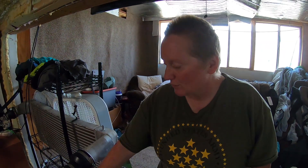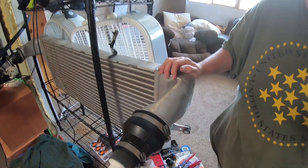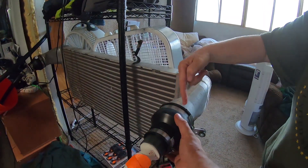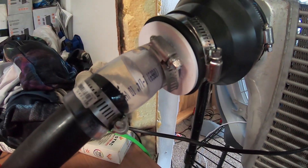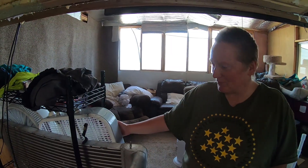To go over again for those that don't quite get it: the piping is all underground. You get a pump to circulate the water, and then the cold water from the ground comes up through a radiator. You can use any radiator as long as it doesn't leak — this one is an air cooler out of a big truck, aluminum, so it won't rust. You can use car radiators, motorcycle radiators, or go to the junkyard. The water pumped through the fins extracts cool air, and then your fan blows the cooler air out. It routes through the ground again and starts the process over for a lot less electricity than compressor AC — poor man's AC.